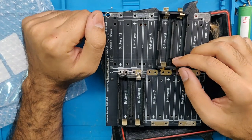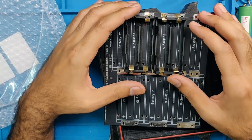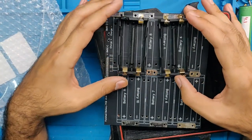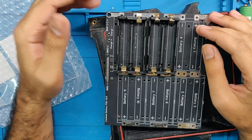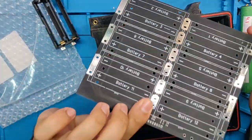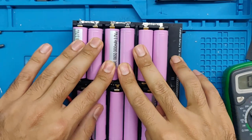Another person I want to mention is Jehu Garcia, known as Jag, who builds battery modules for power banks. His battery packs have no space constraint since they're for things like solar battery packs sitting on the side of your house — just a PCB stacking on top of another with a spacer. But when you have space constraints and want to fit 24 cells and a PCB in a small 25 by 20 box, that becomes a problem. By the way, this is a two-sided PCB — 12 cells on each side, making a 12S 2P pack.